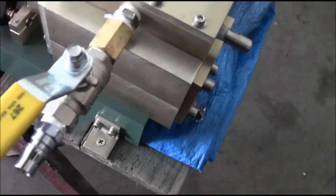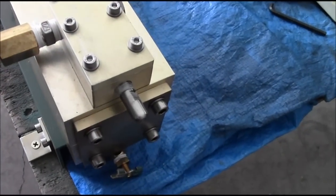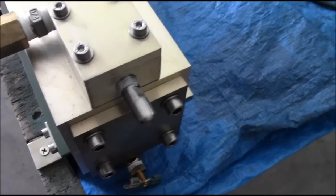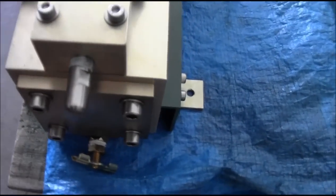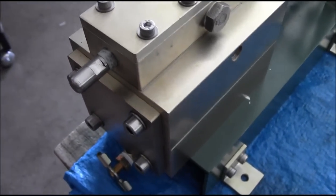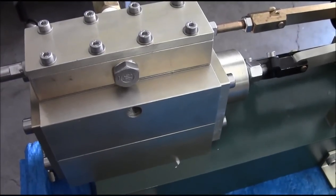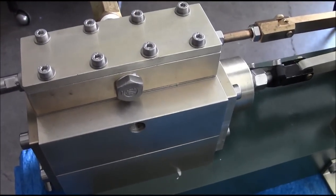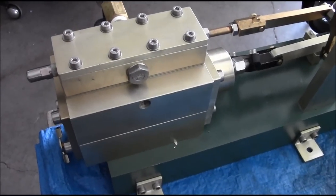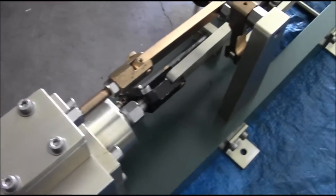I use compressed air to try it out. The guide at the end, the valve rod on the head — I haven't used any sealant of any description, just using metal-to-metal seal at this point in time. The exhaust port during testing with an electric drill was making a fair bit of hissing noise coming out of that port, so I might have to quieten it down a bit.